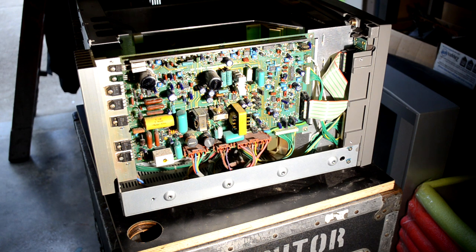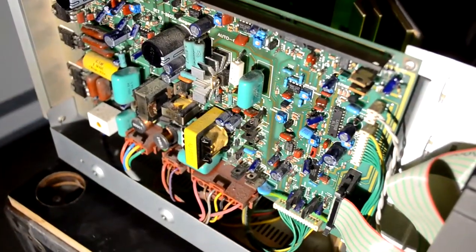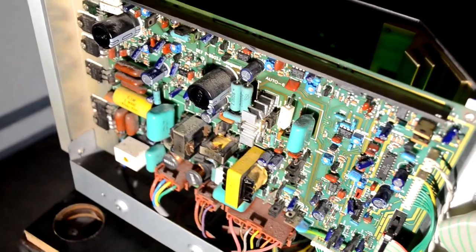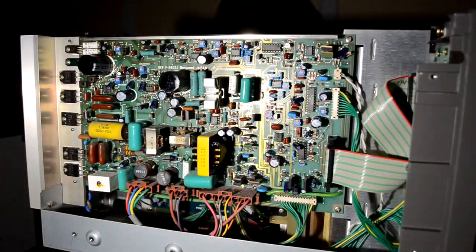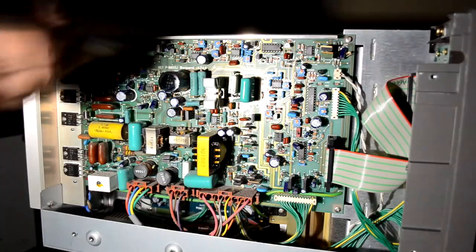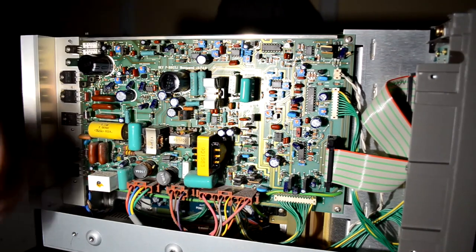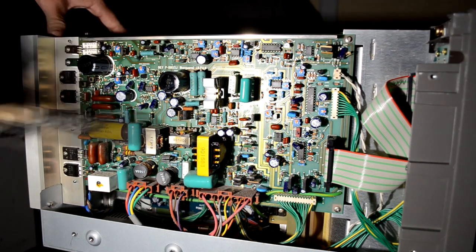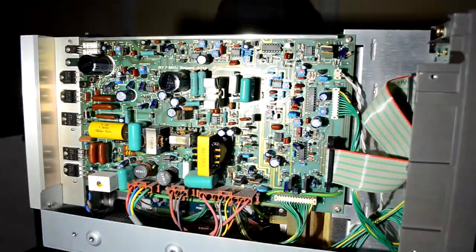Here is our deflection PCB — lots of electrolytic capacitors, and you'll also see some potentiometers that are going to help us with our adjustments. This is deflection board P8803J, a proprietary PCB for Ikigami that controls all the deflection on this CRT. You'll notice there are a lot of ICs towards the back, so a lot of the heat was dissipated towards the back end. We're going to start by cleaning this CRT's PCBs extremely well to knock a lot of this dust off these components.